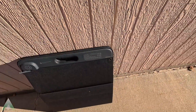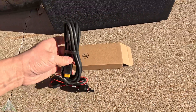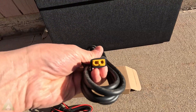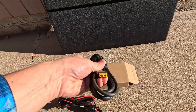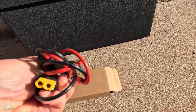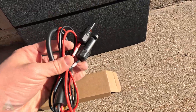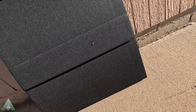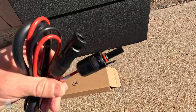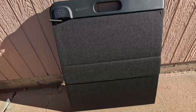We also have two magnets in the corners to help the panel stay folded. They're not super heavy-duty magnets, but they're good enough. In the box, we have two cables: one is XT60 to XT60, female on both ends — one end plugs into the solar panel, the other into your generator or adapter. The other cable is XT60 to MC4 connector, where red is positive and black is negative. There are a couple of polarity variations out there, so if you get this package, make sure you verify that the polarity is correct, because I think there were different types of polarity MC4 connectors sent.